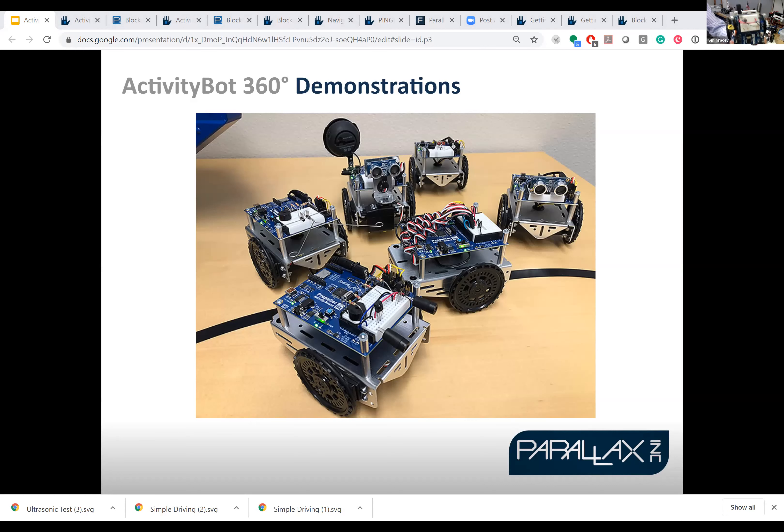Here's a little more complex circuit — this is infrared emitters and detectors. The LEDs, which are in the little black housing, send out IR light, and then the receivers listen for it. Same thing that would be in your DVR remote and receiver. This detects up to about two feet, so it's a form of wireless detection. This one may not work well with black baseboard because it absorbs light. The same circuit can also be used for robot following — instead of bouncing off of it, you can actually train it to follow behind another robot. If you tape a business card or a three-by-five card behind the robot, it can follow. And that's really cool for line following.